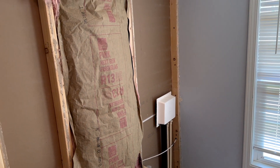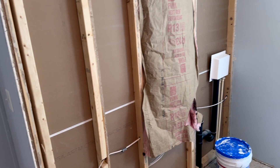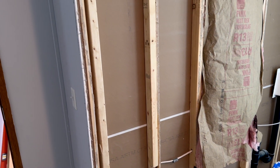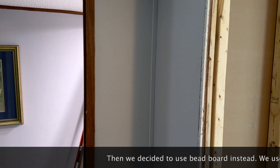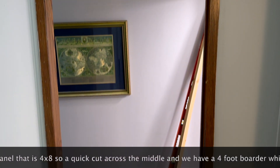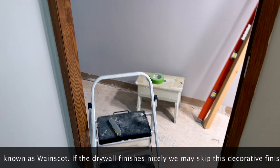So we're getting started on the second bedroom, the spare bedroom here in the mobile home. We aren't quite finished with the laundry room project — we still got to cut in the plumbing for the washer, then insulate and cover with drywall. Then we're going to shiplap this wall and wrap the shiplap around to the door through this corner, so all this old trim has to go. We'll need to pull the trim off of the door so we can install a new standard size and tight door. We're not real crazy about these mobile home doors.